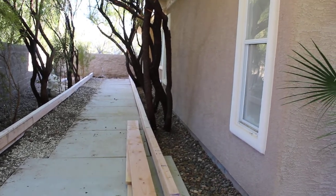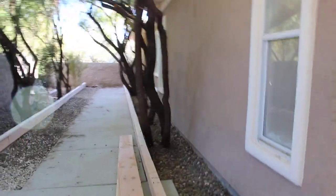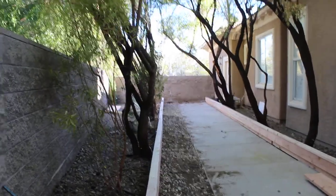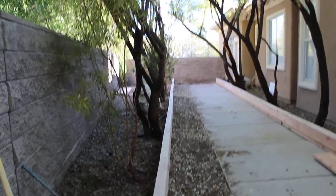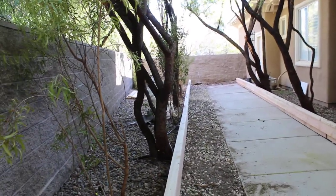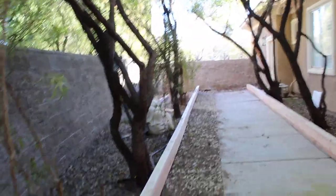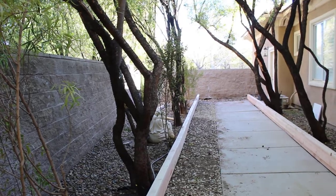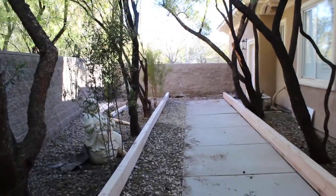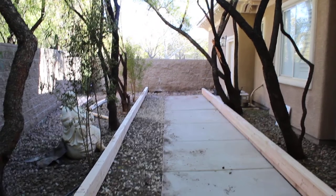The frame here is very ribbon-like — this is horrible. This side also has some very pronounced bends in it. At this stage, given the cost of lumber and all the labor that's gone into it, it should be as straight as an arrow, and it is not. So the concrete that would be poured into here would come out looking pretty bad.